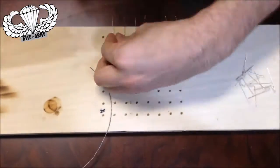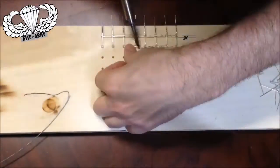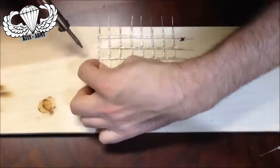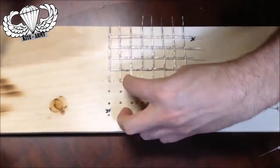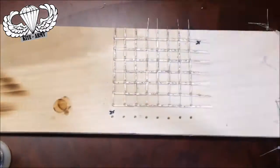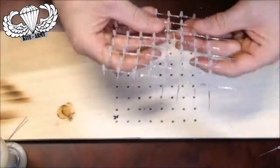This is the fun part of the video — I'm actually putting some things together. You can see I have a board drilled out that matches the size of the LED lights. That keeps your grids nice and square and helps things come together later. I'm soldering them together and every now and then testing the rows of LEDs to make sure I don't have any bad LEDs or ones I overheated, and replacing them right on the spot. Very straightforward — if you follow those steps you'll have great looking boards.